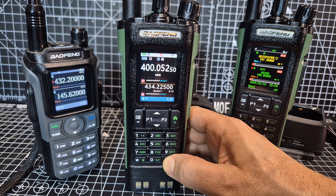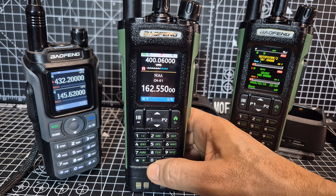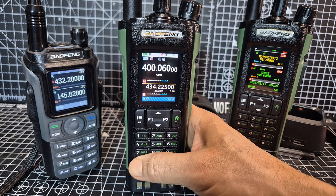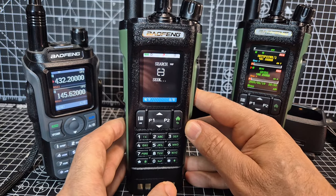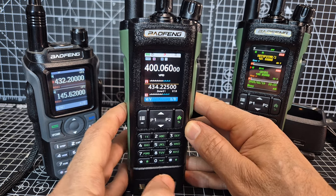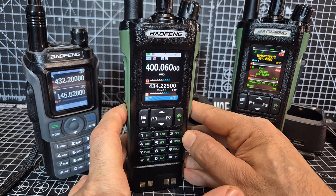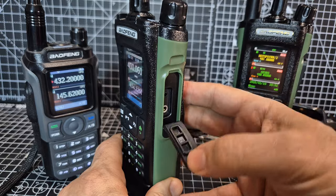Okay, speed. Hold it again. Hold the 0, you go into the weather channels. That's USA. Hold the star and it locks. You hold the bottom button, it searches. If you hold it in, squelch off. Press the one beneath the PTT, we have broadcast radio. Hold it in, alarm, and the LED flashes. You've seen the twin PTT.